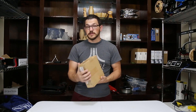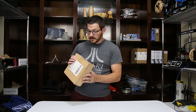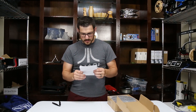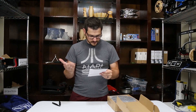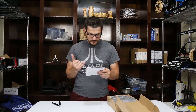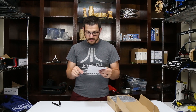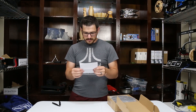This is the box it came in. I don't know if this is the retail box, but it's a plain brown box with just a sticker on the side. It tells me it's 1kg of TPU and it's black. I love non-clear filament! Inside there's a data sheet that gives you all the different settings you'll need — spool specifications, weight, filament tolerance, notes about colors. They give you settings for PLA, ABS, PETG, PLA carbon fiber and wood, HIPS, and TPU. They used to have PVA but they've stuck a TPU sticker over it.